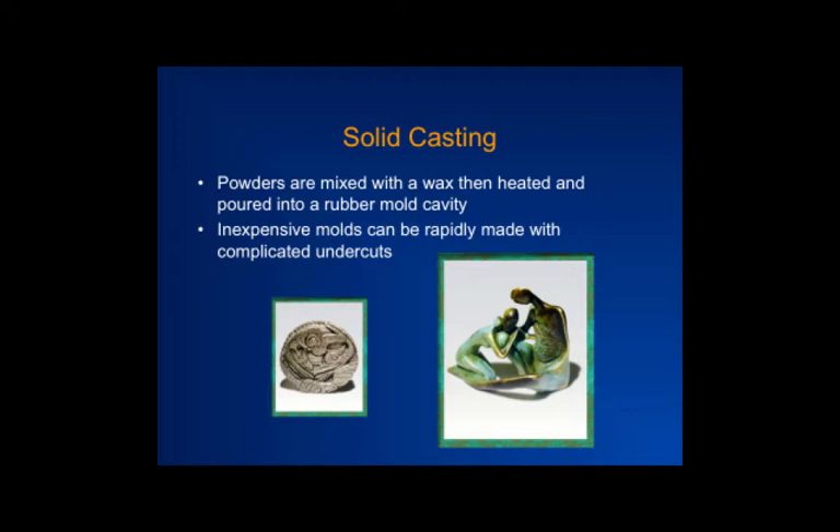In the traditional lost wax method you need one mold for each part, whereas with rubber molds you can reuse them. Also, in traditional casting you heat to the melting point of the material, making it difficult to control surface detail because the material can react with the plaster and the air. With powder-based processing, if you have bronze particles you can control surface porosity, so when you add chemicals to apply a patina — making it green, brown, yellow, or black — that porosity absorbs the chemicals more readily, giving much more vivid colors.